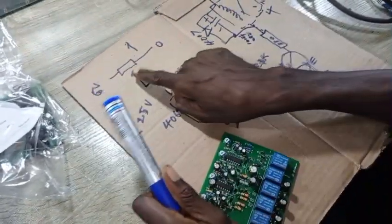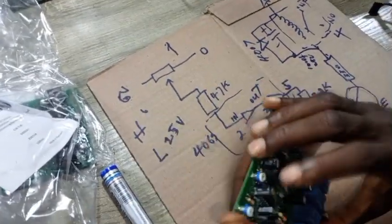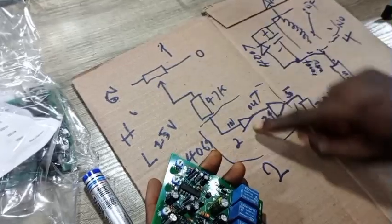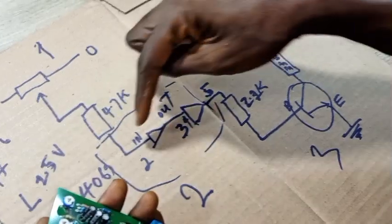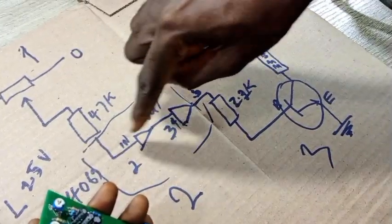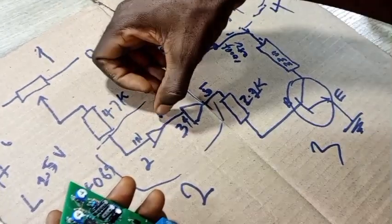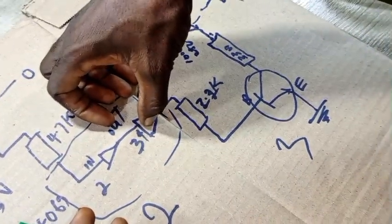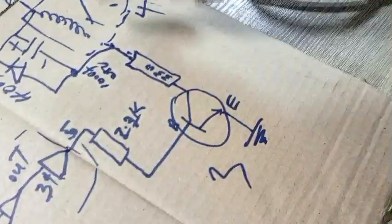Let's assume you vary this one to the low side. If you vary it to that place and it tends toward 0 — meaning it goes below 2.5 volts — low comes in. The function of this IC is to invert whatever enters: if low enters, you get high; if high enters, you get low. So if you vary to the low side, here will be low, the output will be high. But that output is fed into another section of the CD 4069 — meaning here will be low again. If here is low, this thing senses it as low, so the relay will not trigger.